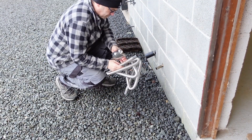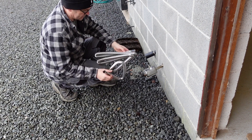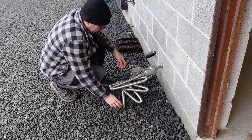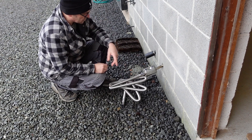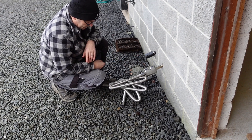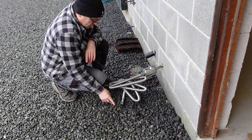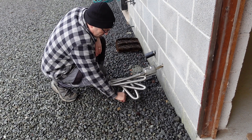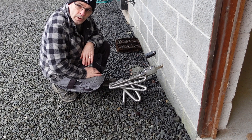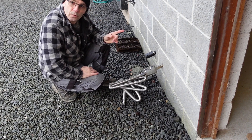Here's the plan: put the silencer on the existing pipe and just add this three-metre section to it. It's not ideal because there's a bit of restriction, but it's a fairly basic silencer — literally a straight-through pipe with a bit of baffling. I want to see it run okay, no loads of smoke, and ideally I want this end to still be hot so we know there's heat to recover from the next length.